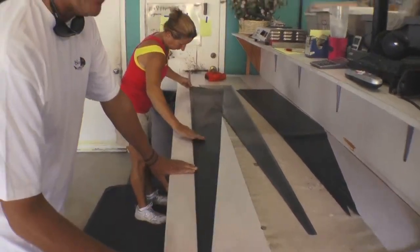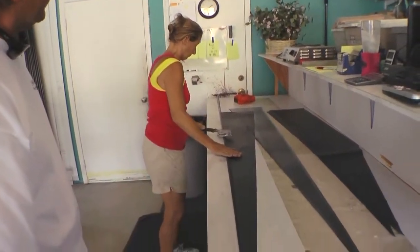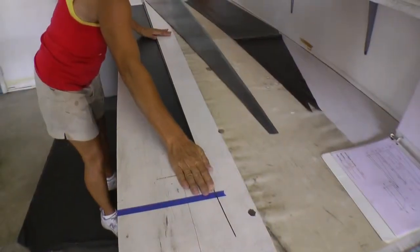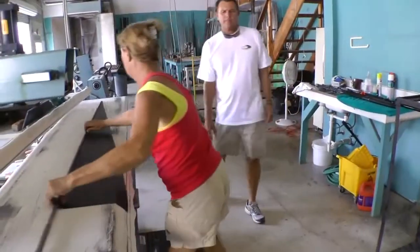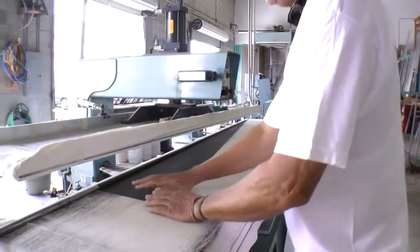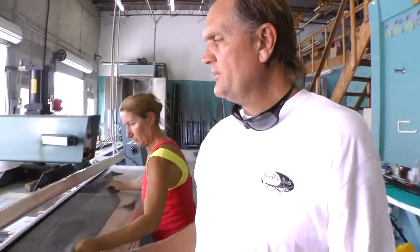As this material heats, it starts getting very sticky and very tacky, so it becomes very hard to work with, especially in the outdoor elements. It's next going to come over to the rolling table. After this first piece is on, like I was telling in the beginning, it can be one piece up to 8 pieces depending on the style or the taper that we're trying to create on the rod. So the second piece of material is going to come and get laid in here.